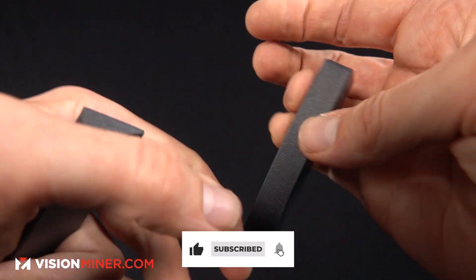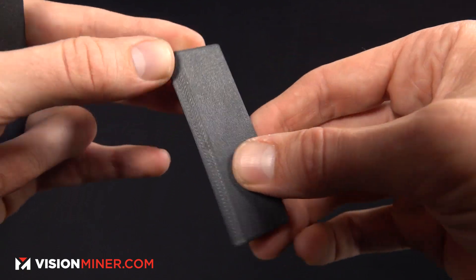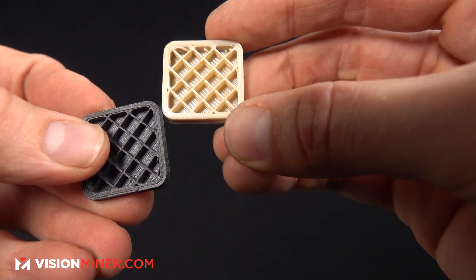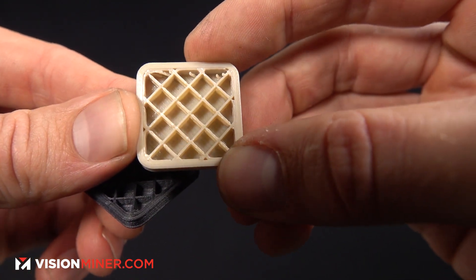The texture is very smooth — almost a matte black — and you can't feel any fibers; it comes out perfectly flat. The bottom line: if you have a choice between carbon fiber and standard PEEK, always take the carbon fiber. It makes your life easier and your parts look better. That said, vanilla unfilled PEEK has more certifications and more use cases where it's been used for 30-plus years, so it's just more vetted. The carbon fiber version is so new that there aren't yet years of experience, testing, and certifications behind it.